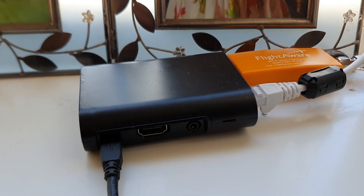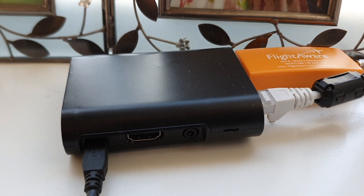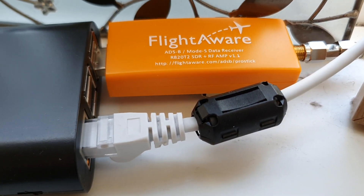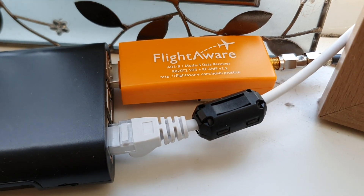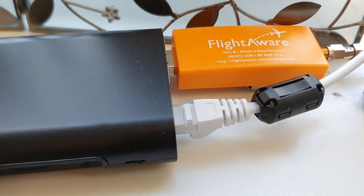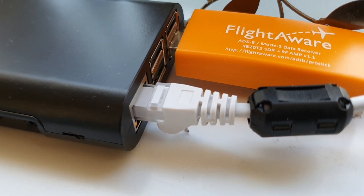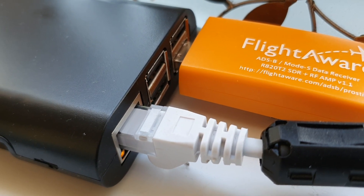This is how I've got the little unit set up. That's the Raspberry Pi unit and that is the FlightAware dongle, FlightAware Pro. I've fitted a couple of ferrites on because I obviously operate on my radio — I don't want any RF getting into the network cable when I'm transmitting. So I've got a couple of ferrites on this network cable which is quite a long extension — a 30-foot, 10-meter network cable — and that just plugs into the back of the Pi. You can see the USB socket there for the FlightAware. That's how it all configures.